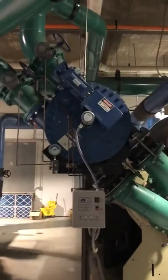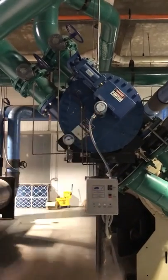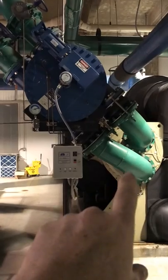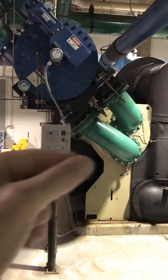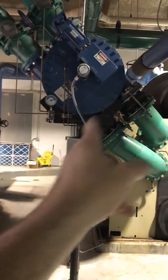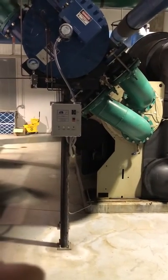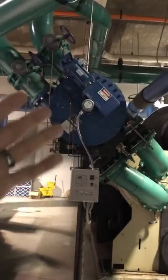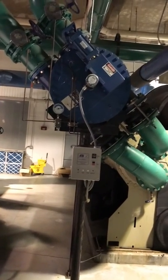What we have here is an automatic brush machine — a toothbrush machine. It is not something you're going to see standard on most chillers; this is an add-on the customer requested when the building was built. Each one of these tubes — there are about 200 tubes on this chiller — has a small brush inside it. A large valve periodically changes the direction of the water, pushing the brush to one end and then back to the other, cleaning the inside of the tubes as it goes. It cuts down on maintenance and is a high-cost front-end item, but not something you'll see every day.